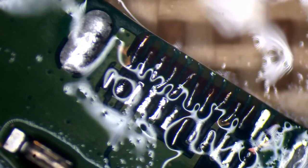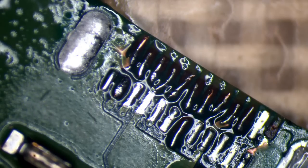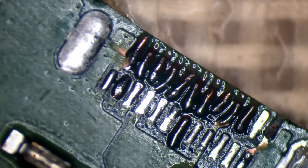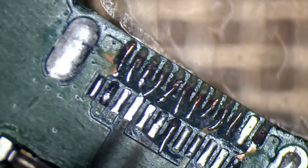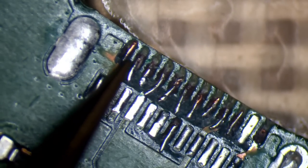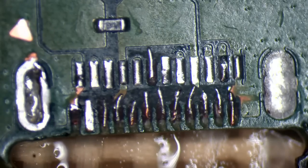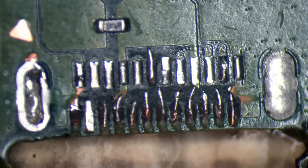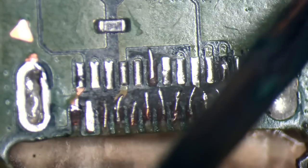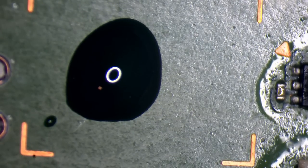It's just typical that my soldering iron decided to die during quite a frankly very fragile time. It's already broken once and I've repaired it, so I think it might be time to get a new handle. I only need enough jumper wire on these to actually make contact with the pad. I know they're not pretty, but you're never going to get 12 jumper wires to look really nice. I'll get some UVH 900 conformal coating and drop just a tiny blob to the side.